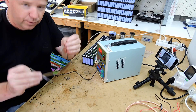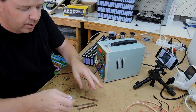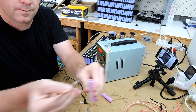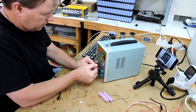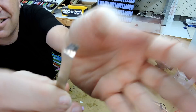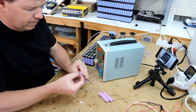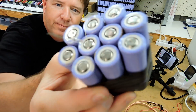I'm going to hit the fast forward button on this whole section. At the end of the day, spot welding the nickel strip didn't work really well at all. The really fine stuff that came with the kit worked — the thinnest possible stuff worked well and straight away. The thicker stuff I could hardly get to stick at all. I don't know whether that was my technique, inexperience, or the product itself, but I'll be investigating further.